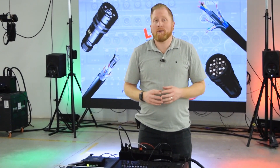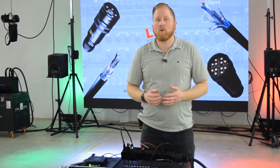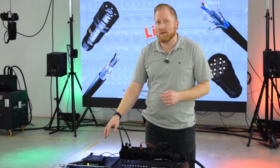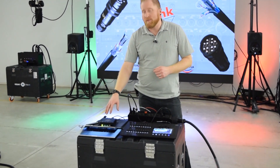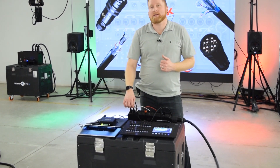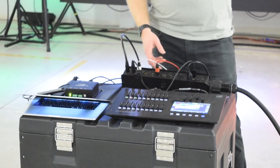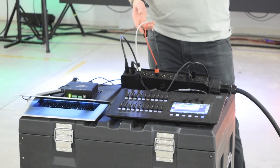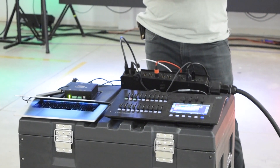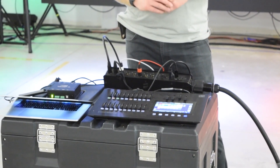What we have set up here today is a real-world application. We're actually using it for video and lighting transport along with analog audio. Out of my one ethernet I've got an IP encoder taking the HDMI out from the laptop, converting it over to IP, and sending it to a decoder on stage. We're also taking that second ethernet and using a widget to break out and send our DMX signal from the console to our lighting fixtures. I'm using the digital lines for my analog audio coming out of the computer to supply audio for the video. I've also got power running the console and the laptop — again, all in one single connection.